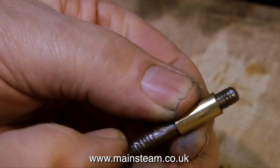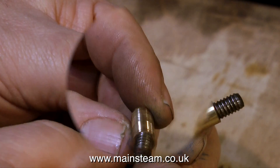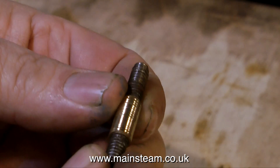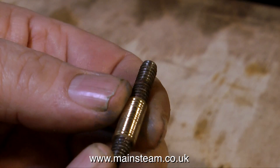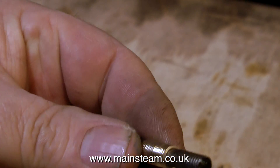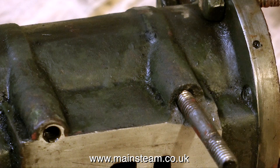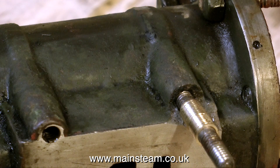As you can see, it's a nice easy fit on the stud because I do not want it to bind. This clip shows the sleeve with the external grooves machined. I'm just re-checking the fit after putting the thin sleeve back in the chuck to make sure it hadn't been crushed and become too tight a fit on the stud. Before I can obtain the finished dimension of this sleeve I need to fit it in place, because I will need to profile one end to fit the damage.